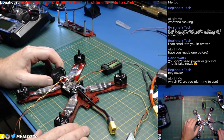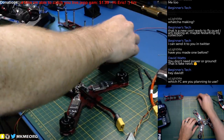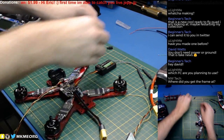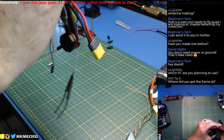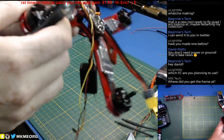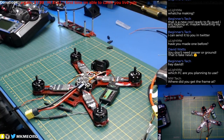What I'm going to do is trim those connections. I put pins on the top of this flight controller so it would be a little easier to solder to, because I knew we were going to solder two wires to each power and ground and a single wire to each video. I went ahead and pinned it — these are just standard 0.1-inch headers, nothing crazy, the same ones we use on Arduinos and Raspberry Pis. They shot all over the room when I trimmed them, but that's perfect. Let's make a little pinout so we know what we're doing.